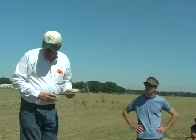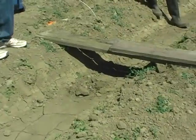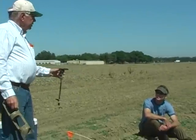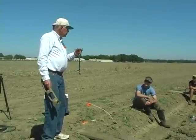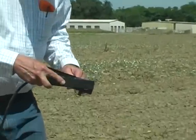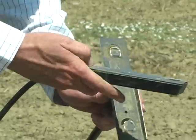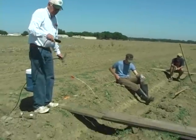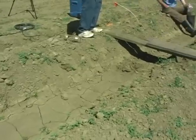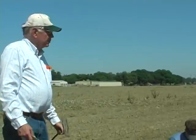What I worked out is to take a three-inch bucket auger, auger a hole down to the depth so this sits flush on the surface, stick this in the hole, and then take the soil and backfill the hole and pack it as we're backfilling. When I got done with this, you could not move it at all — it was really solid. And then the sensor simply slides in with these slots. These inserts have to slip right into these particular sections, and it anchors it in. The real work on your part comes in developing the relationship between depth of flow and the cross-sectional area, and then installing this. When you're done, you need to get this out, and that's easy — the soil is wet and saturated, so just take a shovel and work it out.